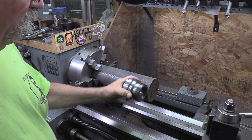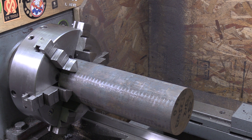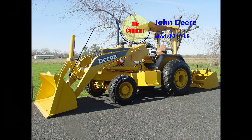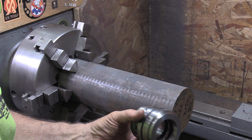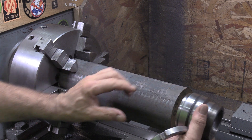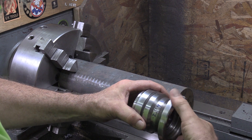Ray has an issue on his John Deere 210 LE — the tilt cylinder for the bucket. He has only one cylinder that rolls the bucket. The gland started leaking really bad, so he's acquired the seals and sent me the gland. This gland goes into the cylinder, there's a snap ring that holds it in place, and then this nut goes over that.